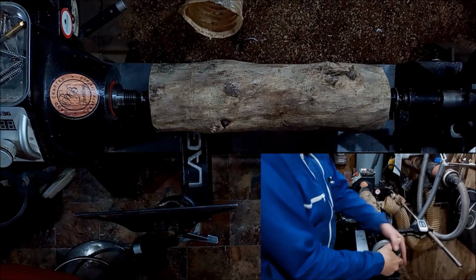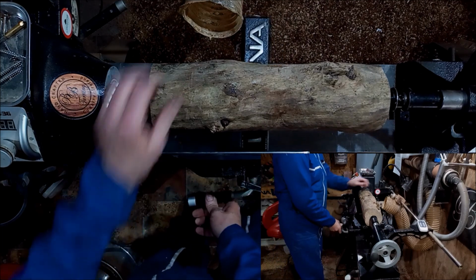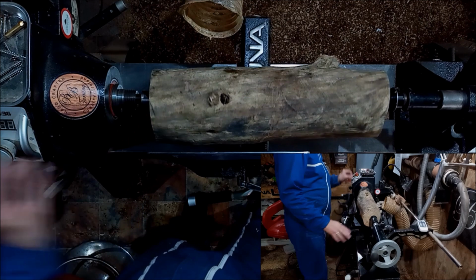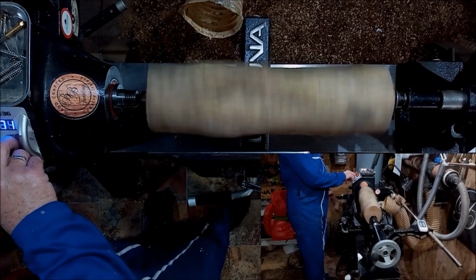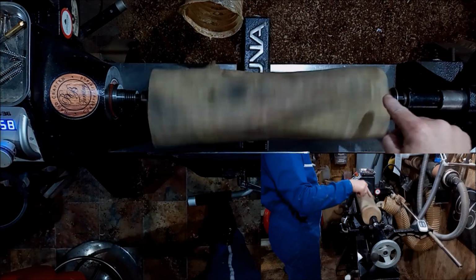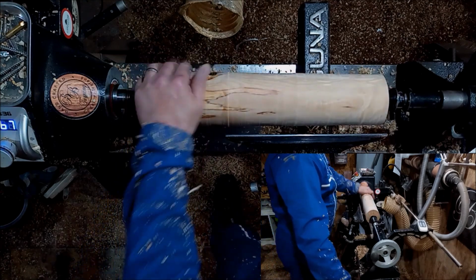And then crank it down. As I said, what you're interested in first is getting that hole to be dead center. Now, I'm going to be off here, so I've got to line this up properly. I've also got to watch my speed. Now, first thing I'm going to do is round it off, paying special attention to this end. Right then, round it off roughly.